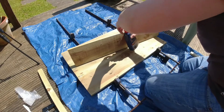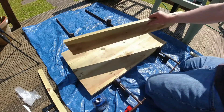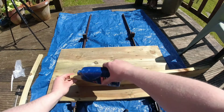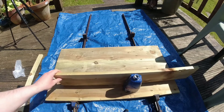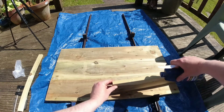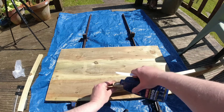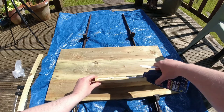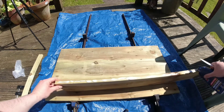The first task is to apply a bead of glue to the edge of that board. I'm using a tried and tested product I've been using for years — Evo-Stik weatherproof wood glue. I've found it really useful and it never gives me any trouble. I'm using a plastic cutlery knife as a spreader to apply a bead to that edge. These bottles come with a red plastic cap and small nozzle, but over time that tends to get clogged, so the easiest thing is to take the cap completely off and pour it straight out of the bottle.